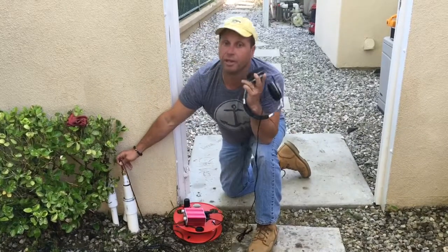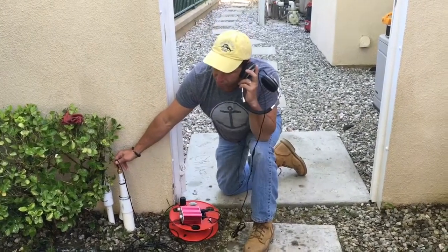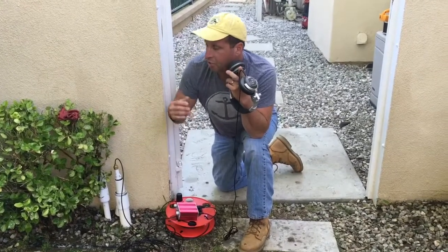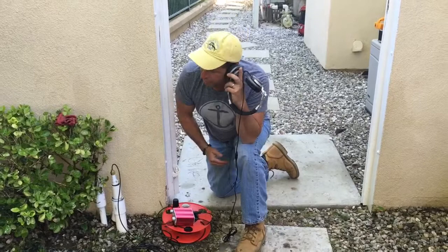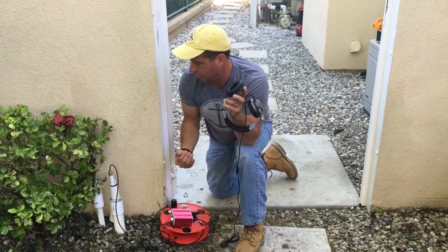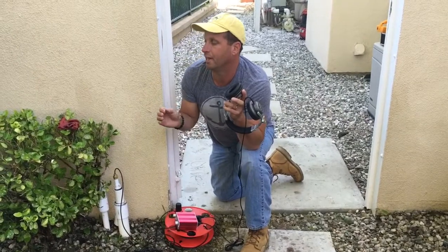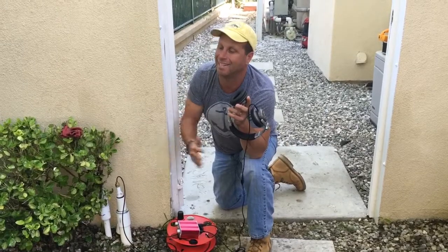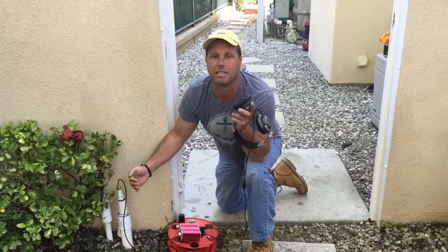Now that I pulled it, we got within our sounds, so we're going to introduce that sound now. We're right over it as we speak. The microphone head is over the leak. We're hearing that jet now, which we're going to introduce to you — the jet noise. Now that we know that the mic head is on top of it, we're going to send the frequency to the mic head, scan it, and the mic head is at the leak.